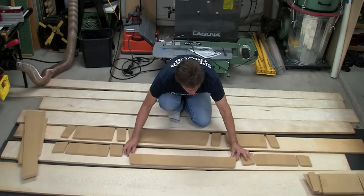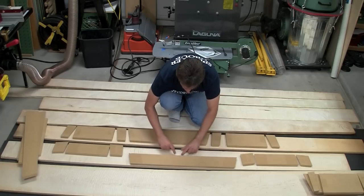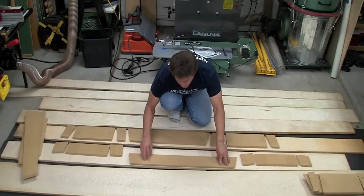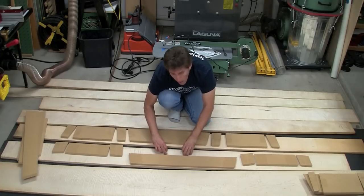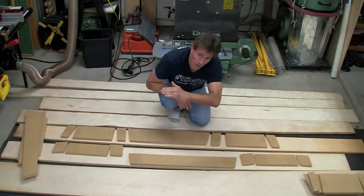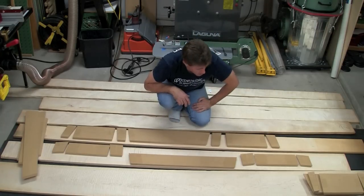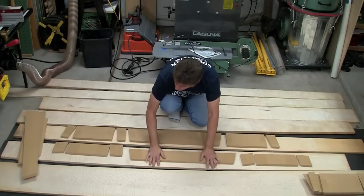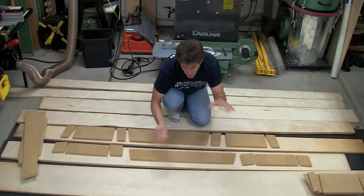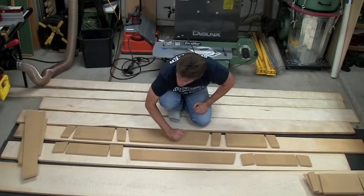It's because I'm going to be making the cuts from the bottom of the board, and then this off cut, I'm going to be marking it so I know where the drawer stock came from so that I can use these to create the top triangle that's going to be beveling back in. That way I can get the grain to be continuous over that bevel at the top of the cabinet. Now the cuts for that are the same angles, it's exactly like taking this top piece, making a second one, flipping it upside down, but just not making it quite as wide.